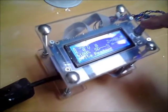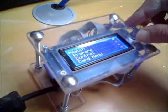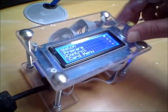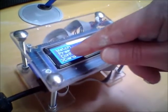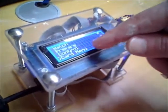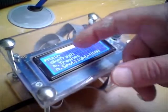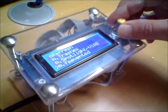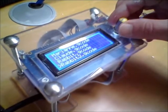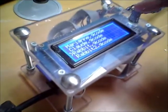This is your only control button — you press that one down and it comes up. Then you scroll by turning; you turn anti-clockwise and we go down to 'Card Menu'. I don't use Prepare, I don't use Control — Card Menu. Press again to accept that, and all the files that are on your SD card are there, so we're looking for a rabbit. The last file to be put on is at the bottom, and I press that and the printer starts going away.